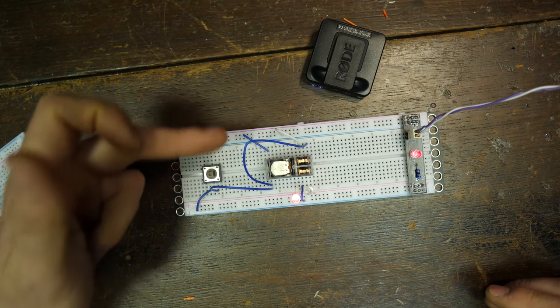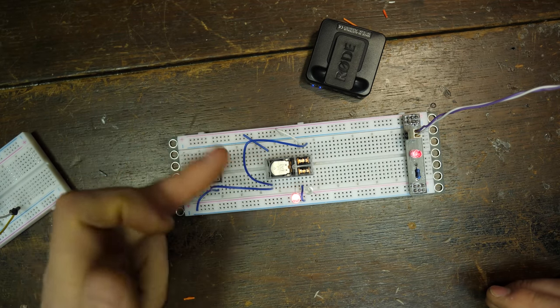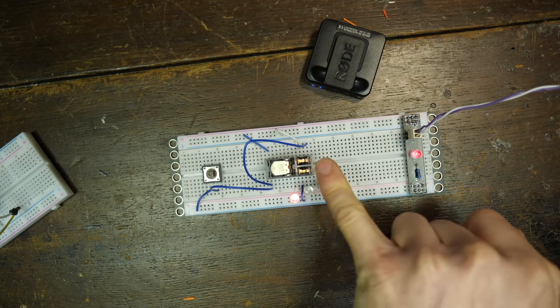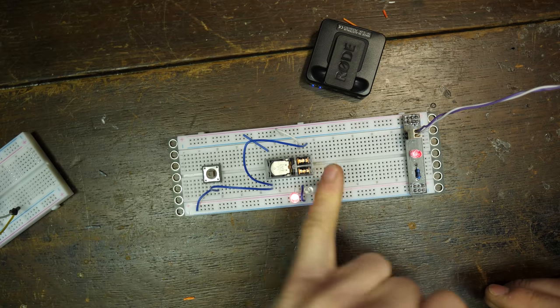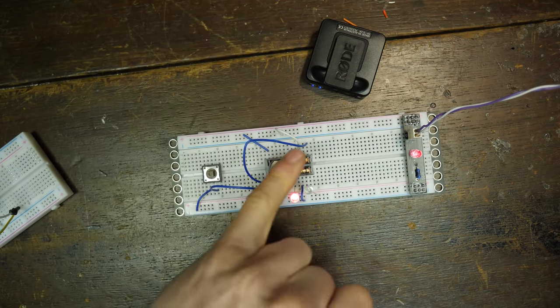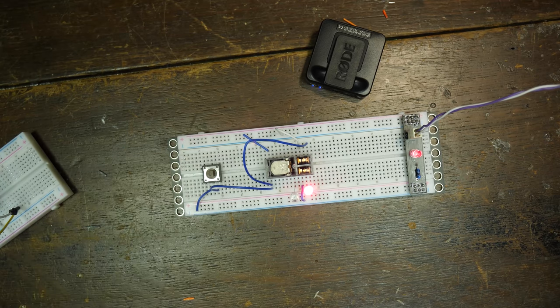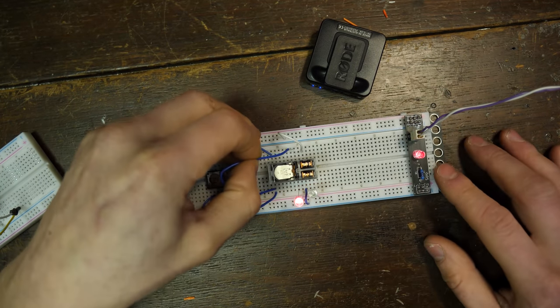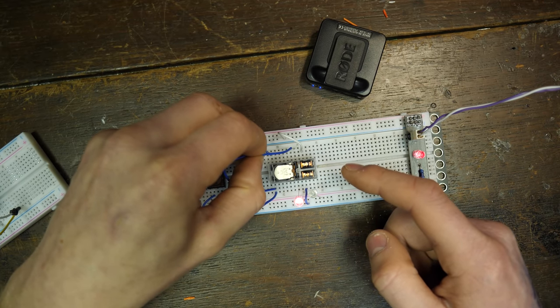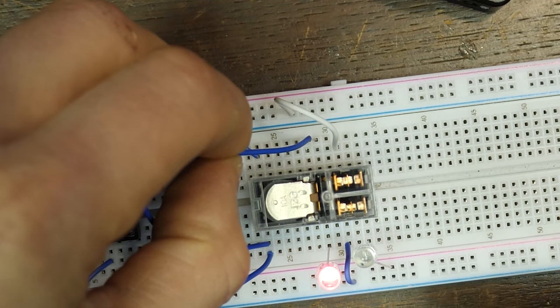So when you push the switch, it completes the circuit, so it makes the coil flick down, and then this makes the switch actually push forwards. But because the ground is also connected there and there, it makes it latch on and it stays on because it's making a complete connection when it's created. So we flick it over, it stays there. But if I make this connection to the normally closed side of the switch, you'll hear that it actually starts buzzing.